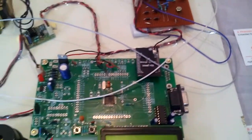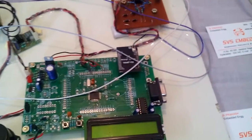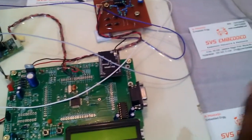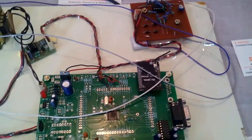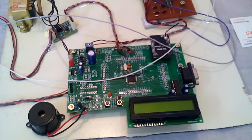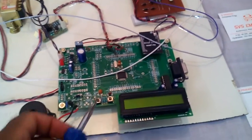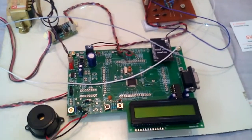I am using an LM1117 and a MAX232 level converter voltage level stabilization IC to communicate from the board to the computer. Using Flash Magic, we are sending and receiving data and the program will be dumped. I am using a 16x2 LCD character display — whatever process is going on in the microcontroller or ARM processor will be displayed on the LCD. LPC stands for low power consumption.